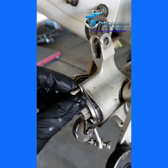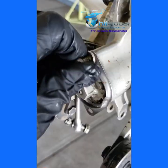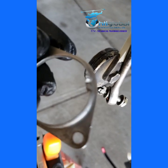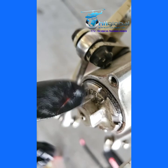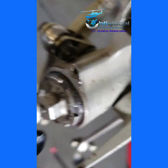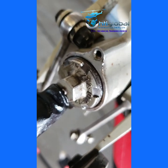When you're removing the crosshead, to make it quicker, we take the lock out safety wire and take these two things out. Leave the lock bent like this because it's going to coincide again when you reinstall. Then you break the torque on this retainer — this is where you put the grease. Grease is done every 50 hours, only two shots.